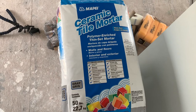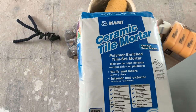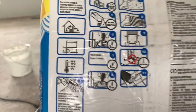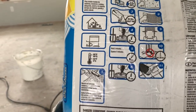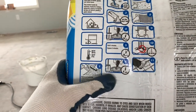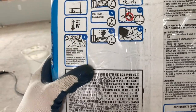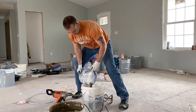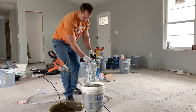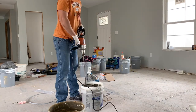The thinset I'll be using is about $15 a bag — this is for ceramic tile, so make sure you get the right stuff. They make a porcelain tile thinset, so make sure you get what you need it for. Follow these instructions to the T — it says wait five minutes after you initially mix it up, then remix it for a whole minute. That is a crucial part of mixing thinset. You may want to wear a respirator when you mix this stuff because it throws up some dust. Don't add more water than you need initially because it doesn't take much to get the right consistency.